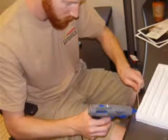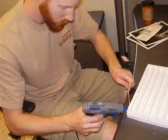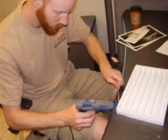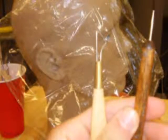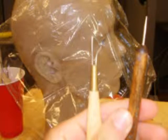When we actually pour the inner silicone jacket, we'll pour whatever's left over to make ribs for the brush-on mold. Chris is using foam core and a hot glue gun to make a little rib mold that we'll pour leftover silicone into. One thing we had not done earlier is finish the sculpture itself — the making of the mother mold didn't really affect or hurt it. So we went ahead and got our thoughts together as far as texture.